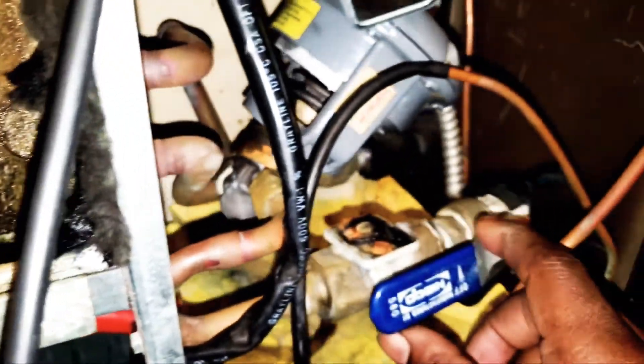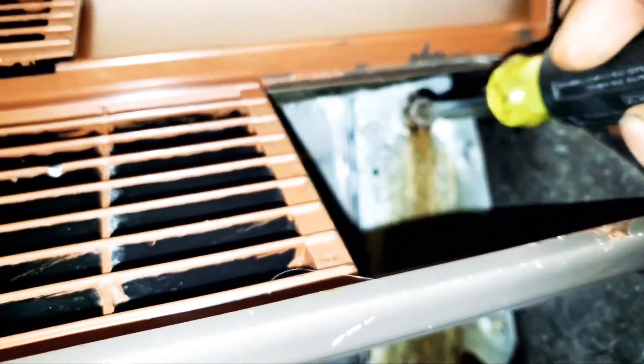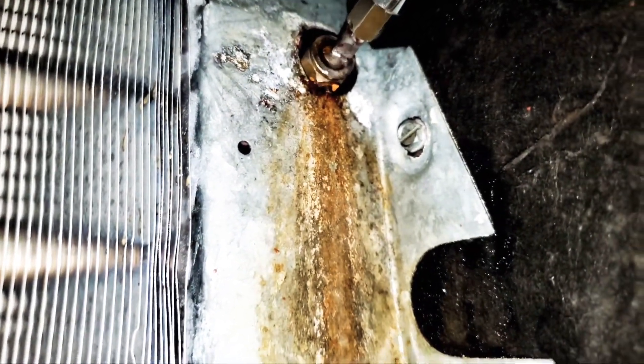We got it on cooler. That's a drain. So we're going to close this return, open this bleeder up here, let the water out. Let that water drain. See how that water is draining? That's going to drain right into our pan.